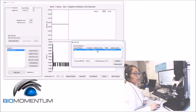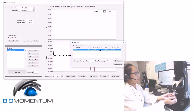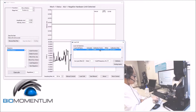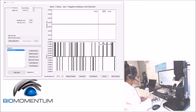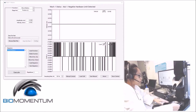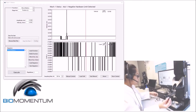Your load cell is now calibrated. You can now remove the calibration holder. Now, let's secure the testing chamber on the base of the MAC-1 using the 4 screws.